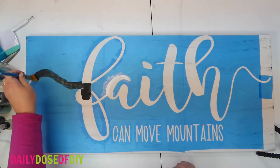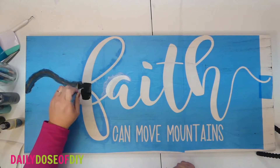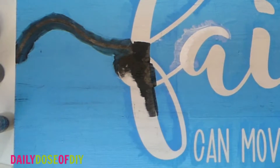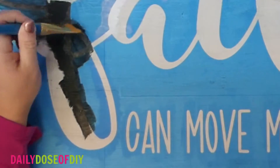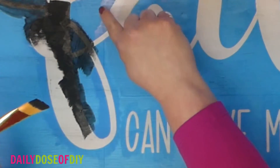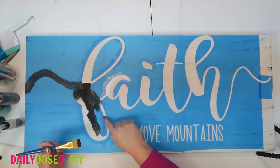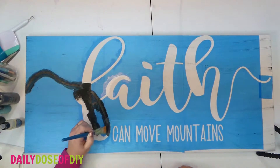You still want to do a light coat of paint. This chalk paint is extremely pigmented so even for a medium coverage paint it might not look like a light coat, but I am doing one. It's much better to do a couple of light coats — it goes pretty quick — than to slap on the paint and risk bleeding. Also, if you're doing an extra large sign like in my previous tutorial, go ahead and Mod Podge any seams where boards were put together so paint doesn't bleed through.